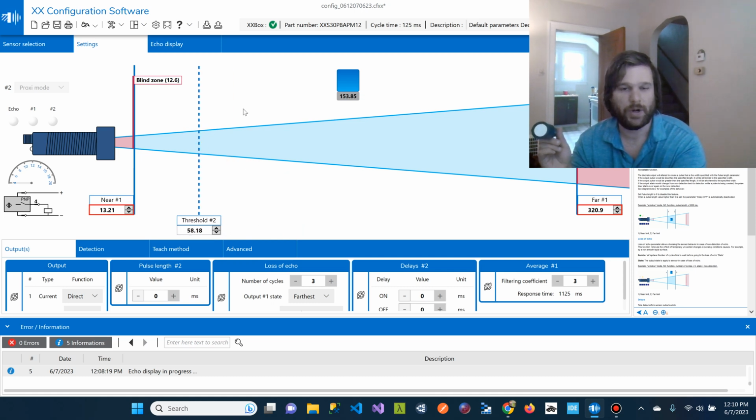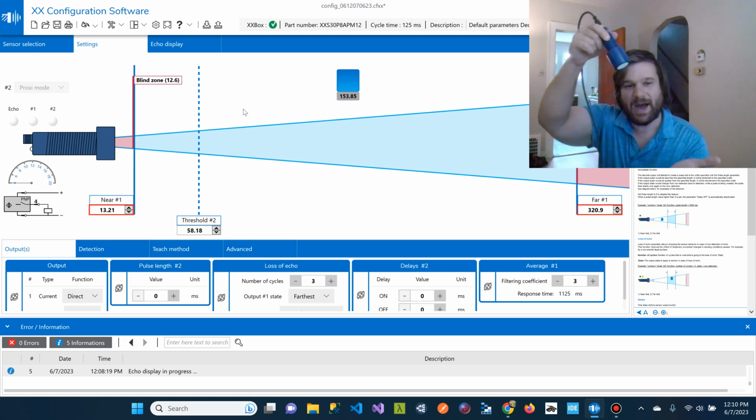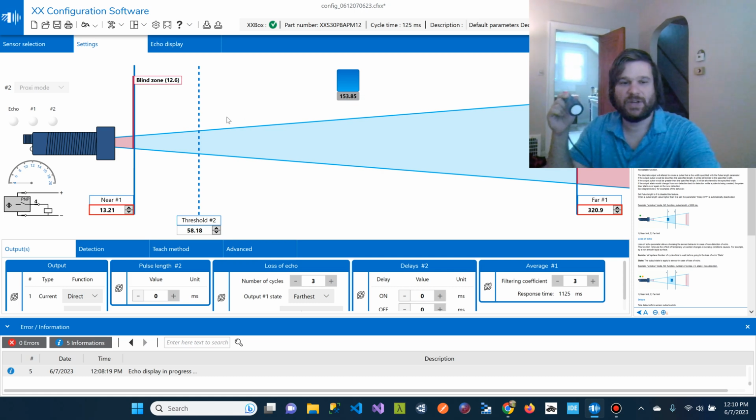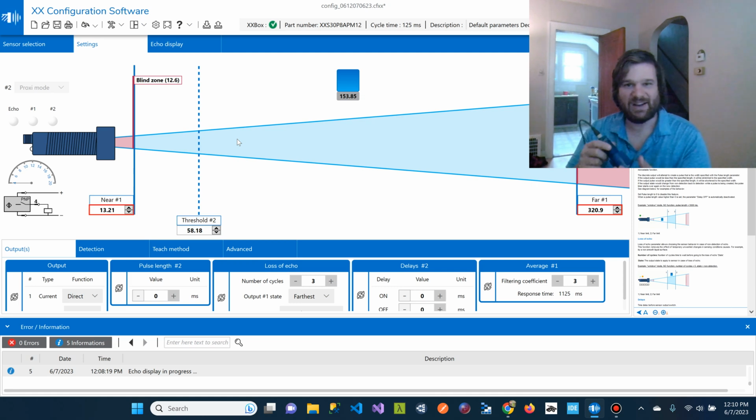And you would use this to say maybe you had a conveyor belt and you were, we'll say you're a rock quarry. So you're creating rock, and then you have this sensor pointing at your pile to see where it's at. And then you can have a discrete value that says, hey, when you get close to the top, where you're at a certain level, trigger that discrete value to change. And then you can have that run back to your PLC and turn off your crusher motor.